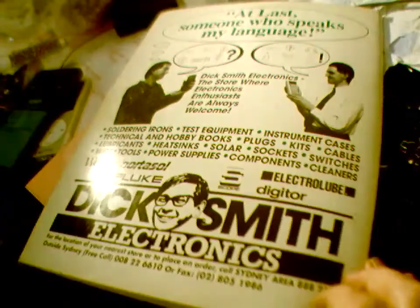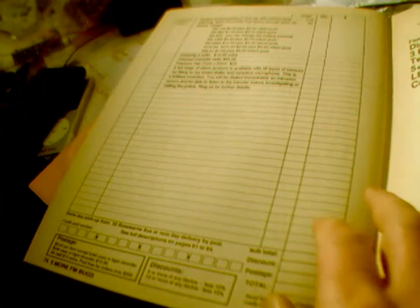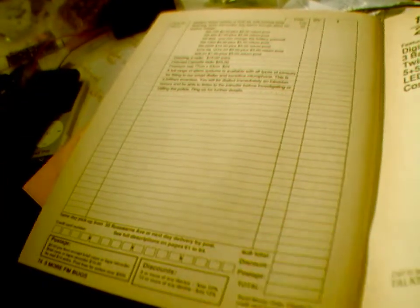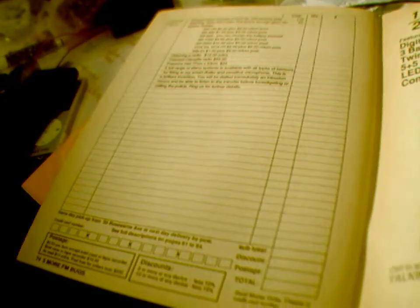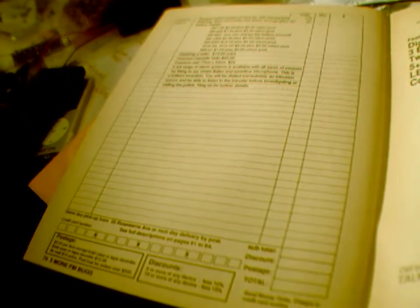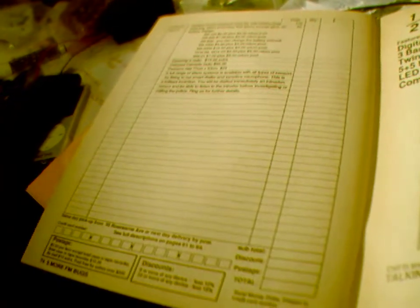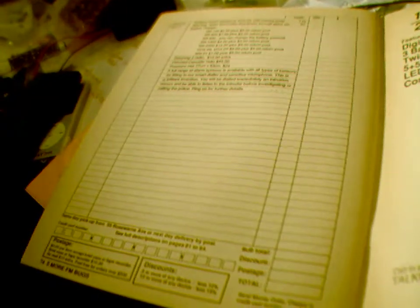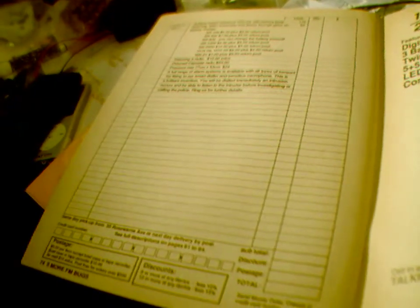Any reference for a crystal set build with a grandson? Emphasis would be on performance. I can't think of any off the top of my head, but make sure you have a crystal set that has a tapped coil, because there are some crystal sets where you just connect the antenna to the junction of the tuning coil and the variable capacitor, and they're really no good unless you're using a short wire antenna, because they'll lower the Q and you won't be able to separate stations.